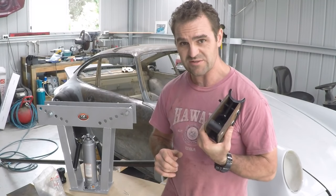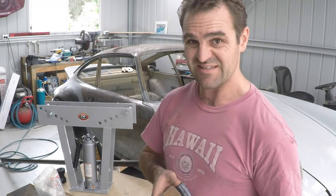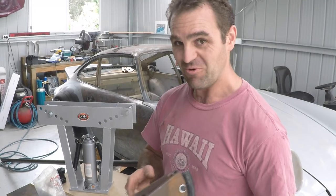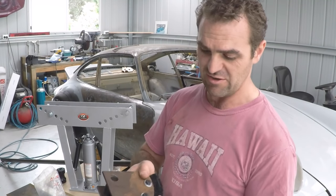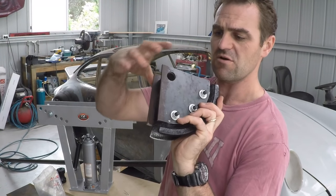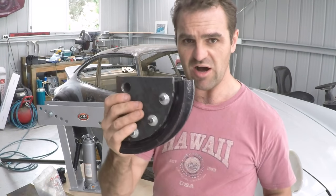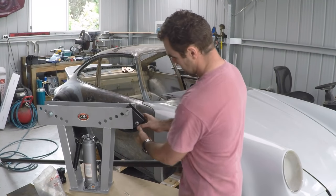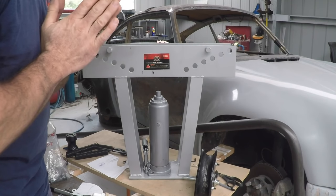The die is mostly done. I cut out these two pieces of plate — definitely not the easiest thing with a hand angle grinder and a 1mm cutting disc, but I got there in the end. I also struggled through with a 20mm drill bit on the drill press cutting through this thick plate. I've drilled the holes through, bolted it together, and got a piece of 20mm pipe in there. The die is set up ready to go and will pivot quite nicely.